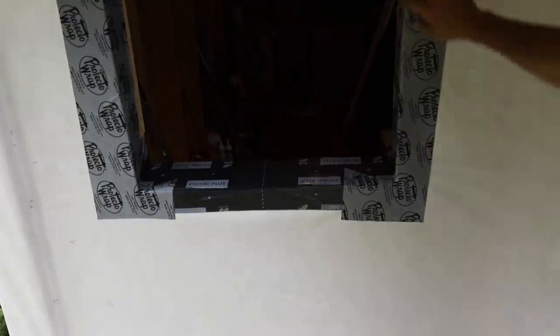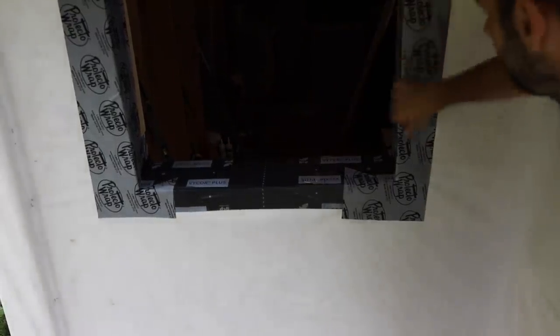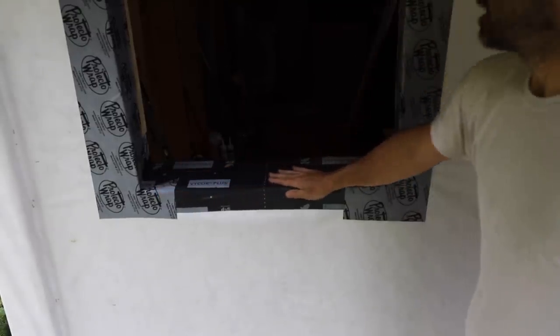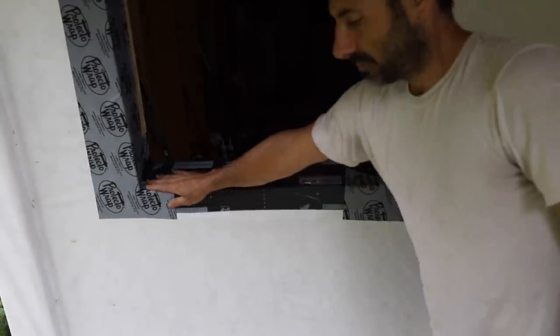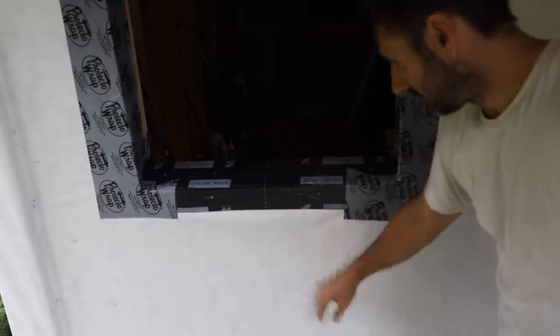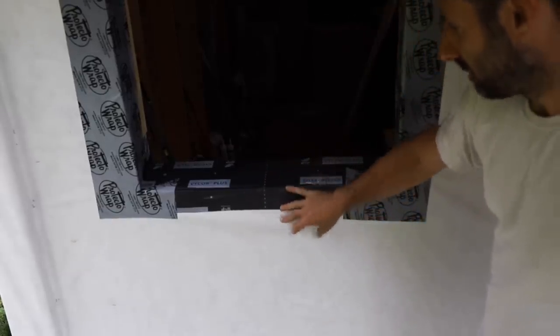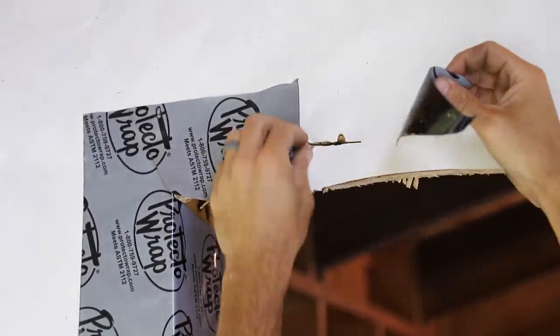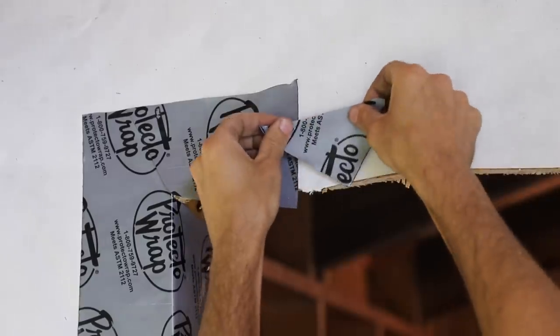All right, so now we've got a nice tilted sill. Any water that gets in here, which is not going to happen because this whole porch is covered, is going to come out and just bleed down here. And I'll have a rain screen so it can go behind it and out down to the bottom. Let's put this little scrap piece here just to catch that too.